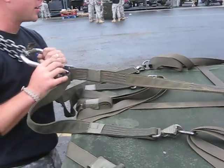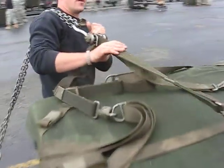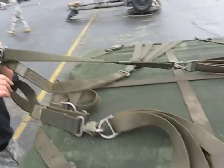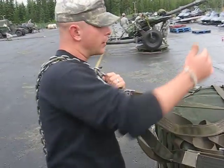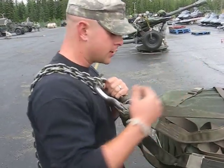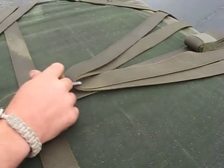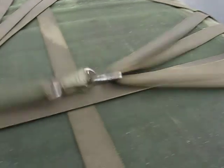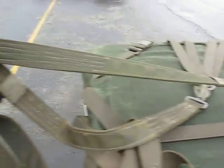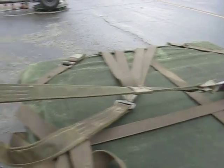Number two is going to cause us to go to the left. Therefore, for the rest of this time, we're going to be moving left around the load. If at any time we have to stop and go back in this direction, it's going to be a deficiency — it means your hooks are out of sequence. We're going to grab our number two, come up here, make sure that our straps are flat, our hook is down, it is taped, no more than half a twist. This is a half a twist — you can rotate your clevis 90 degrees in either direction.